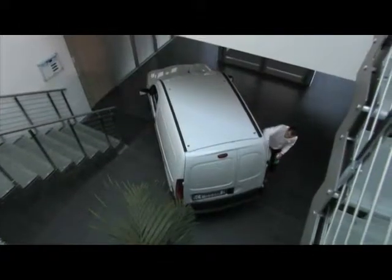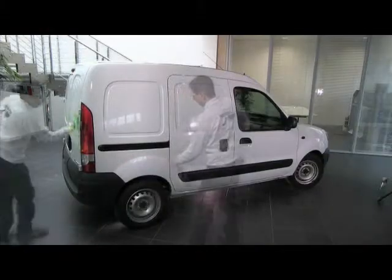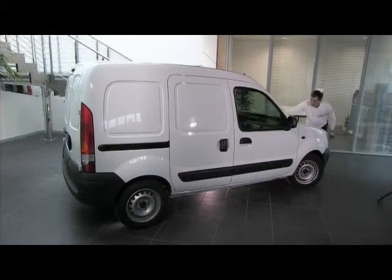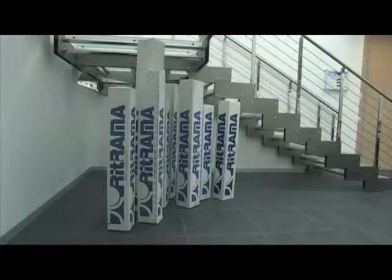The entire substrate surface has to be thoroughly cleaned before applying the adhesive decal, even if it may look clean. Check all joints for possible traces of cleaning solutions.